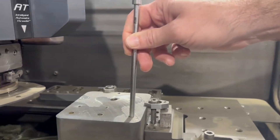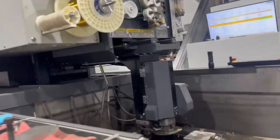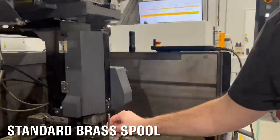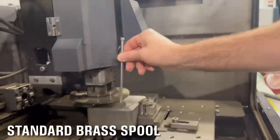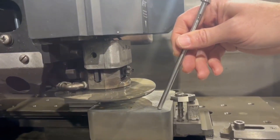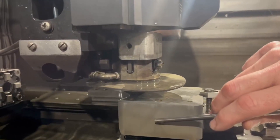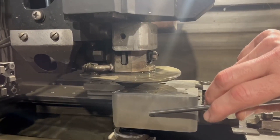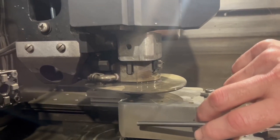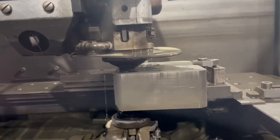We're going to try just the regular brass now — it's loaded and we're starting it. This is the last one, just the straight brass wire. Similar fits on all three holes. Here are the times: straight brass ran 46 minutes 54 seconds; zinc-coated middle-of-the-road wire was 43 minutes 22 seconds; and the high-end wire was 42 minutes 33 seconds.